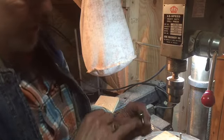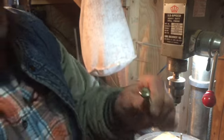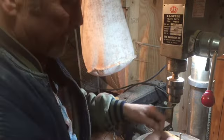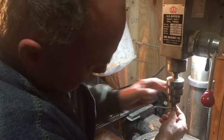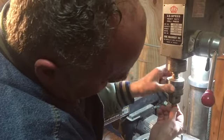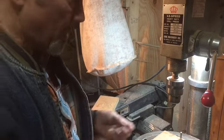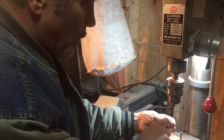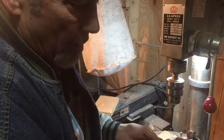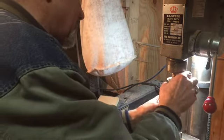What I used to use is I just took a bolt — and if you see on here there's some markings on there, that's to tell you the hardness of the bolt — and I just ground that flat so that I have a nice flat surface. Then I just put it in my drill press and run it up so the bolt is sitting on the bottom of the chuck and just snug it up, and then I would push my parts together. But since then I found this black plastic piece and I just ground the head off of it. I don't even remember what it was for, but it's threaded and it's just got a piece of plastic at the end — I figured that would be less likely to scratch the head of a pin.